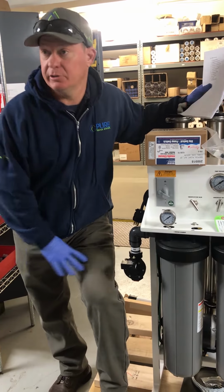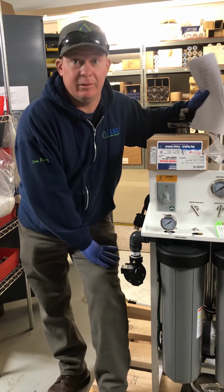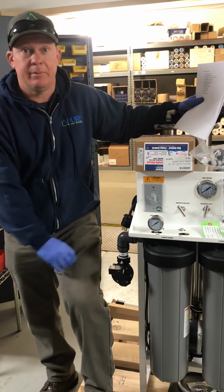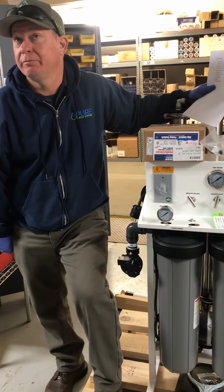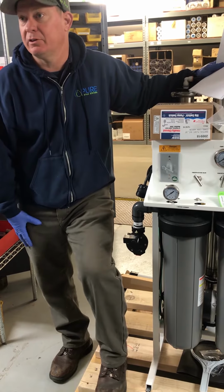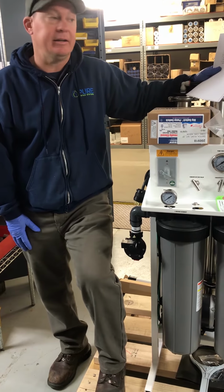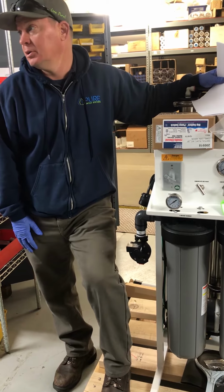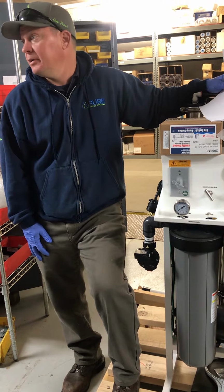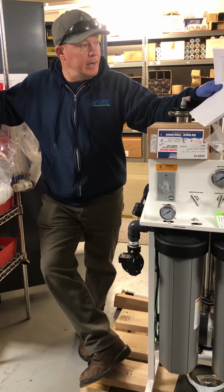So anybody have any questions on the concentrate? If you go out to a unit, and we're doing 8 tenths and only putting a gallon down the drain, let's turn that concentrate up a little bit. We've had 2 of these units up in the Highlands that have smoked their membranes in 6 months or less. In reality, these membranes should last a couple years. The reason is we're not flushing it well enough with enough concentrate. I believe that's an issue.